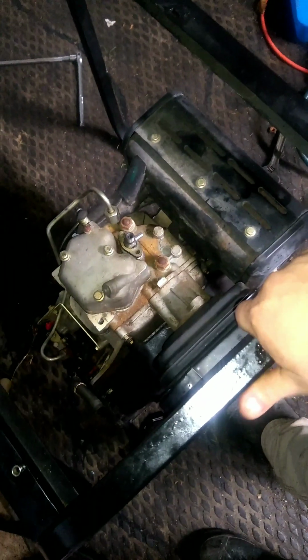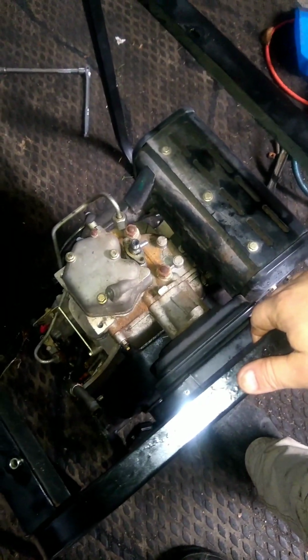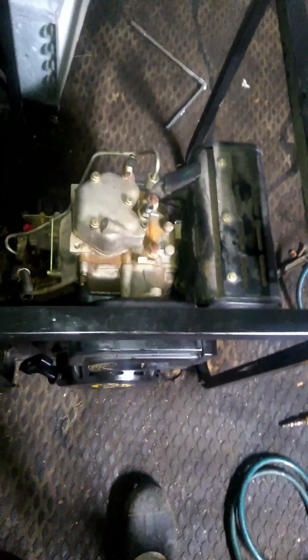Well, I can't tell you how long I've run it. I've had this thing for a couple months now, and I've run several tankfuls of fuel through it. I mean, it's been dozens of hours running through it. Not really under a load, but up at full governed RPM, just letting it sit out there. I call it Smokey Joe because it is mechanical diesel and it was running on straight waste oil, so it just blows a lot of smoke when you rev it up. You can roll coal. The Cummins guys will really like that one, or well, the Power Stroke guys will too, and the Duramax guys. But yeah, this thing rolls coal, a lot of coal, because there ain't nothing stopping it from doing so.